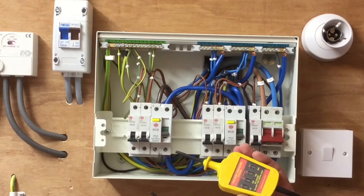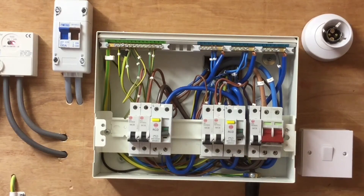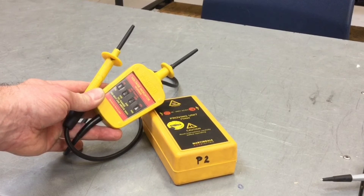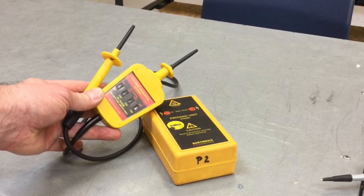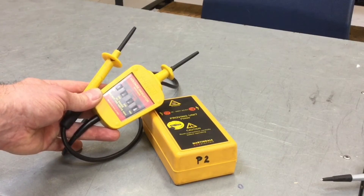We still need to go back and prove our voltage indicator, so we'll plug it back into the proving unit to confirm it's correct — even though the self-checking sequence of illuminated, not illuminated, then illuminated is itself reassuring. Once we've done that we'll be ready to energize the circuits and complete the rest of the live tests in the sequence laid out by BS 7671. The inspector will still expect you to re-prove your tester one final time on completion.